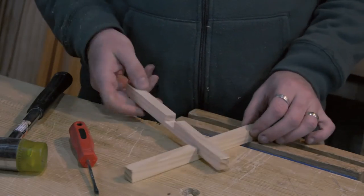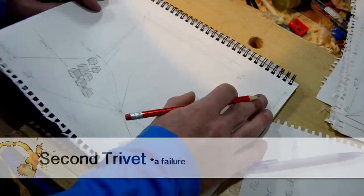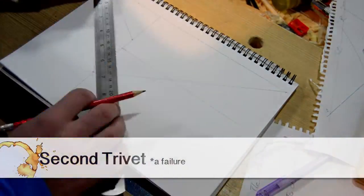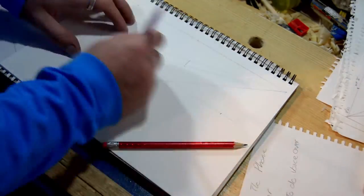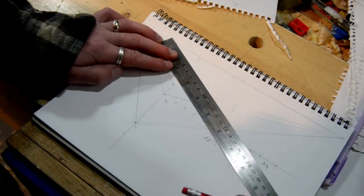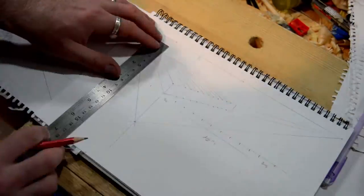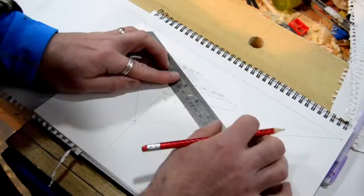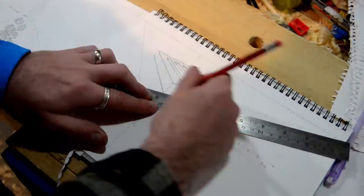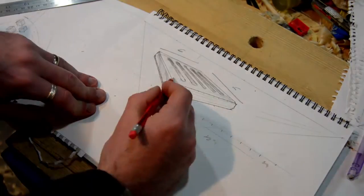The first trivet is not very exciting and it's not a real difficult build — you can get that done in half an hour. I wanted to make one that had a grid pattern in it that went halfway through on both sides. This piece is six inches by six inches, and the grid pattern starts three-quarters of an inch in from all four sides, then I marked another grid inside of that where everything's a half of an inch.